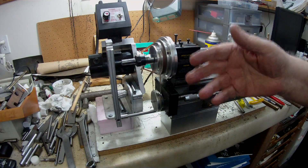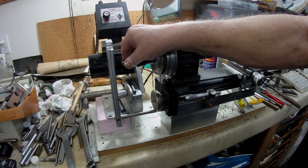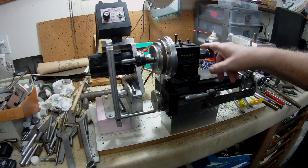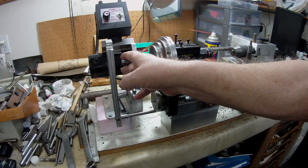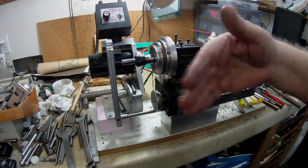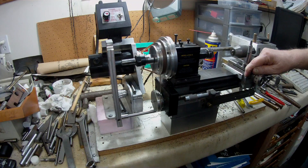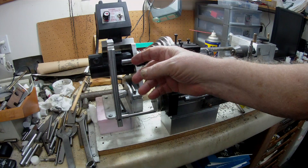You don't really have to worry about the diameter of the master or the diameter of the thread you're going to cut, as long as you've got the same pitch at this end that you want on your part. It could be 3/8"-16 instead of 3/4"-16 — they're basically the same pitch. That's my reasoning there.